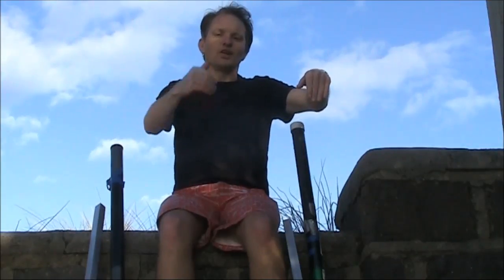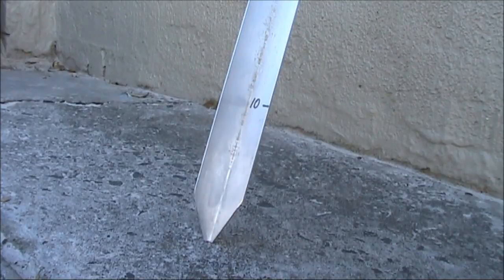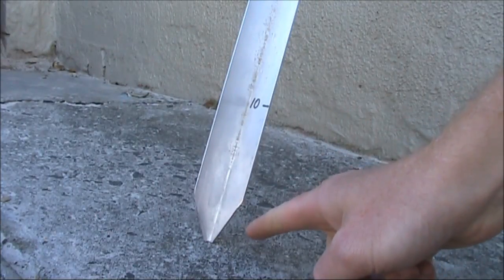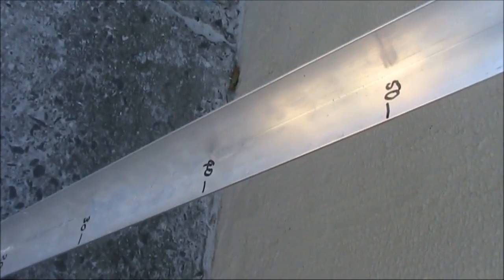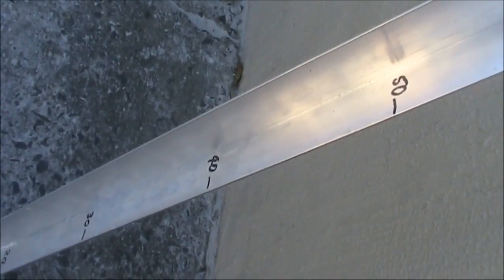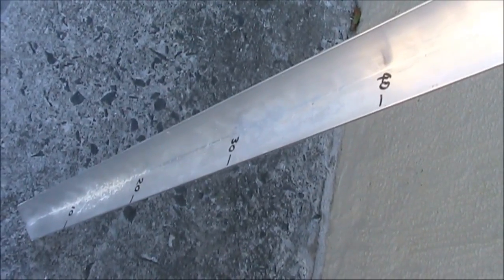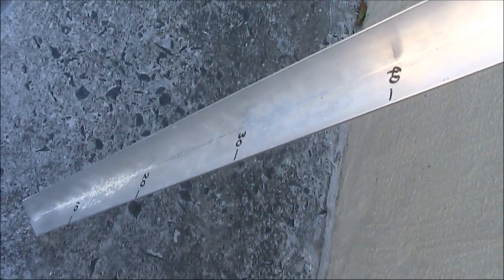The two poles are going to be positioned like that. The water is in that direction, as is long path to the USA. It's bidirectional, with the main lobes being away from and towards the camera. Since I made yesterday's video, I added a point to make it easier to push the stake into the sand. I've also added a distance scale so you can see how deep you've put it in — and it could also be handy for measuring up wire antennas in the field.